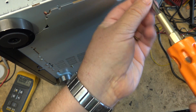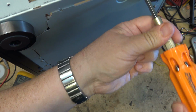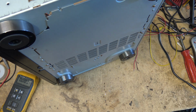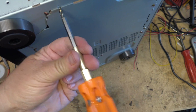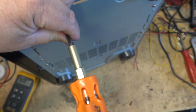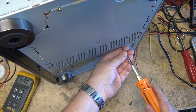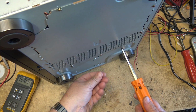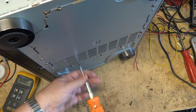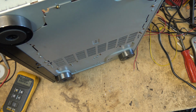I think probably what happened is the amp may have got damaged when it was being connected because it was being hooked up as a BTL. I don't know for sure, but there may have been a problem with the wiring. If any of the speakers were common grounded to each other, that would certainly cause a short. But something blew up 2 channels of this amp. So either a short in the wiring somewhere or a short in the speaker switch. He's running an external speaker switch to run 3 pairs of outdoor speakers. He sets it up this way so they have an independent system for their outdoor speakers.